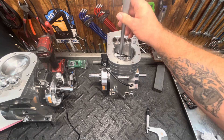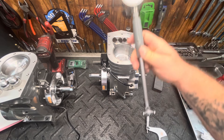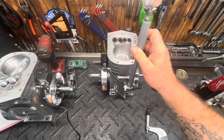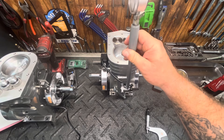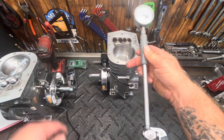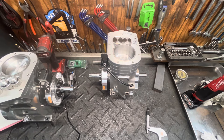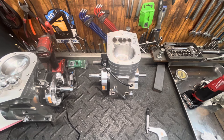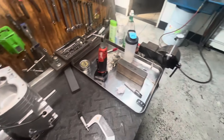Take your dial, run that to zero while you're in there. Kind of wiggle it back and forth, make sure you're getting the highest point of that dial, then crank it to zero. Clamp this down in the vise — very gently, you don't want to clamp it too hard or you'll bend that tube. Let me take the camera and swing it over so you can see it.